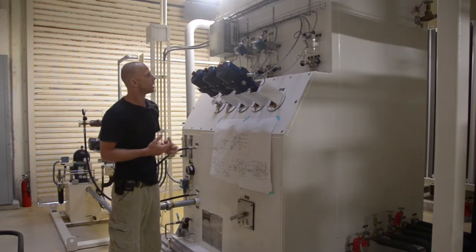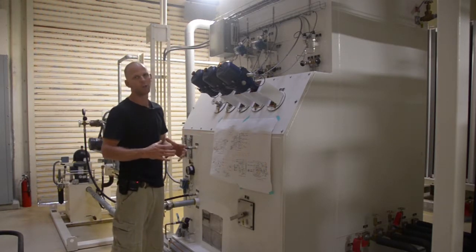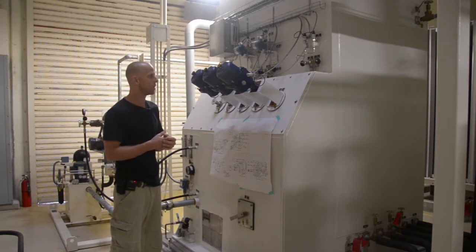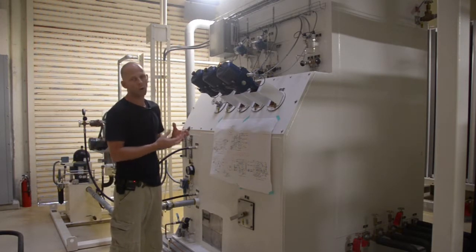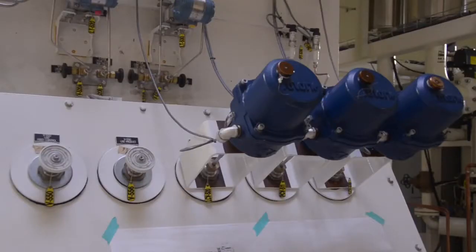All right. So the liquid that moves into our column then forms the basis of a distillation process between the two columns. We have a lower column, a nitrogen column, an upper column, an oxygen column, and they are thermally linked by a heat exchanger known as our reboiler condenser. They're also linked by certain air lines and liquid lines, gas lines and liquid lines, such as our crude feed line, our pure nitrogen feed line. So we control that distillation process with these valves.